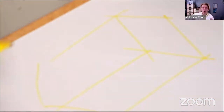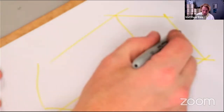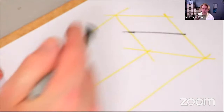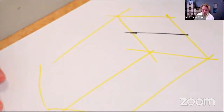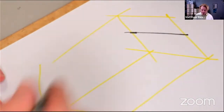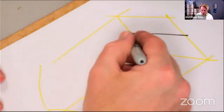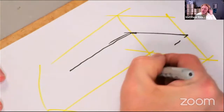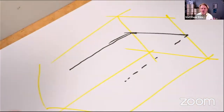saw a small mark, starting with your saw here, and saw a small mark across like that. So don't begin to saw down. Then rearrange the block, and get your piercing saw, and make a mark along here, and then make a mark along here as well. And then slowly join up the dots. I can do a bit of a demonstration, I think.